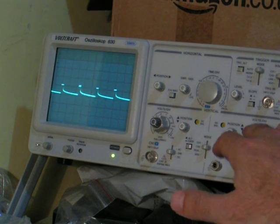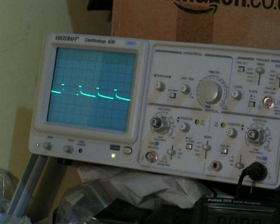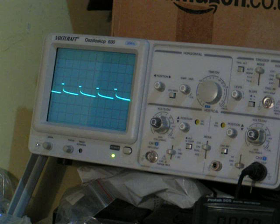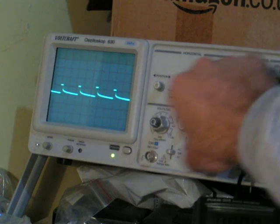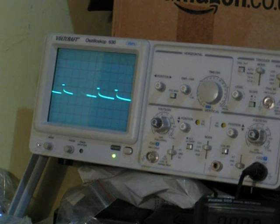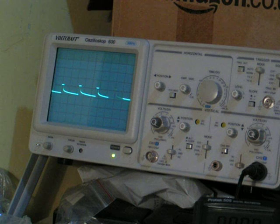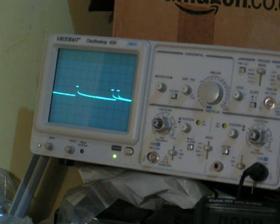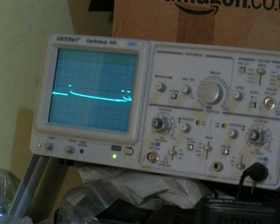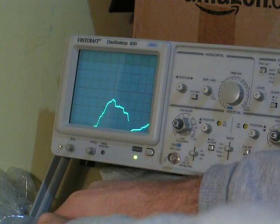The peak-to-peak is approximately 500 millivolts, but if we take it with respect to ground, the top reaches 2 volts. This is exactly what I told you about the GSM time slots — every 4.6 milliseconds. This is the slot that your handset is using to transmit and receive signals from the base station. Now let's see how the output signal sounds through an audio speaker — I'm going to disconnect the oscilloscope.